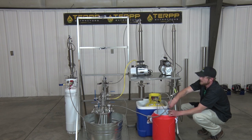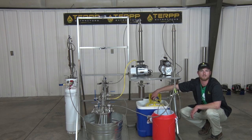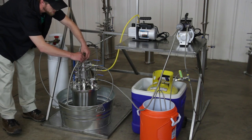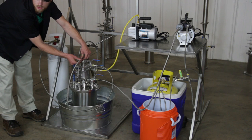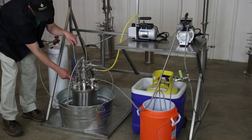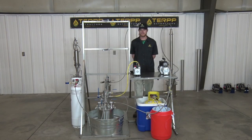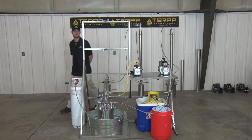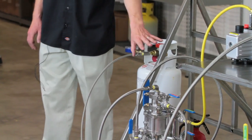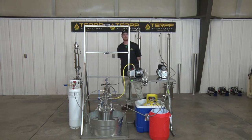Another quarter inch hose from the outlet of this vacuum valve runs to the inlet of our coil. From the stainless steel condensing coil we will also run a quarter inch hose to the vapor valve on our recovery tank. We should make sure that all of our hoses are tight. We should have permanently attached our eight-foot three-eighths SAE hose to our MK4 from the top end cap down to our number two liquid valve. All of the hoses should be secured with two wrenches. Once we're set up for distillation, we want to make sure our ventilation system is operating properly. Once we open our tank and introduce butane into the machine, we'll want any possible leaks of gas to be evacuated from our area as soon as possible. Once we've performed our distillation, we'll be ready to set up for extraction.